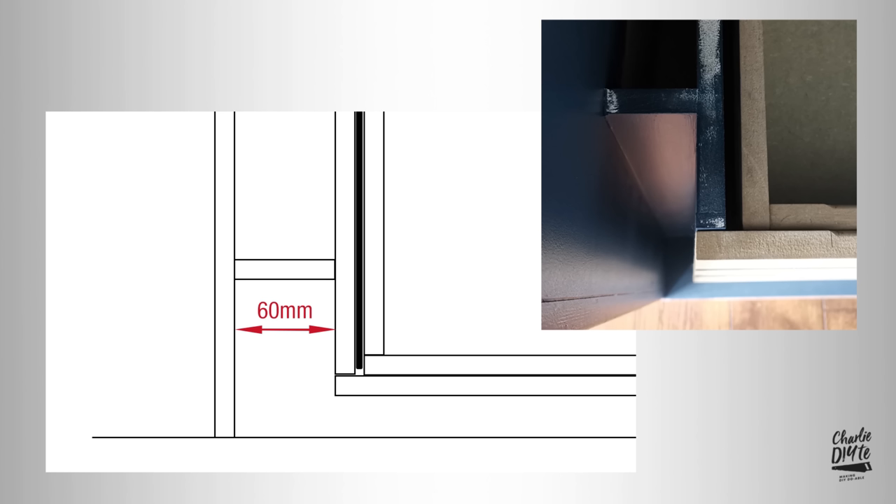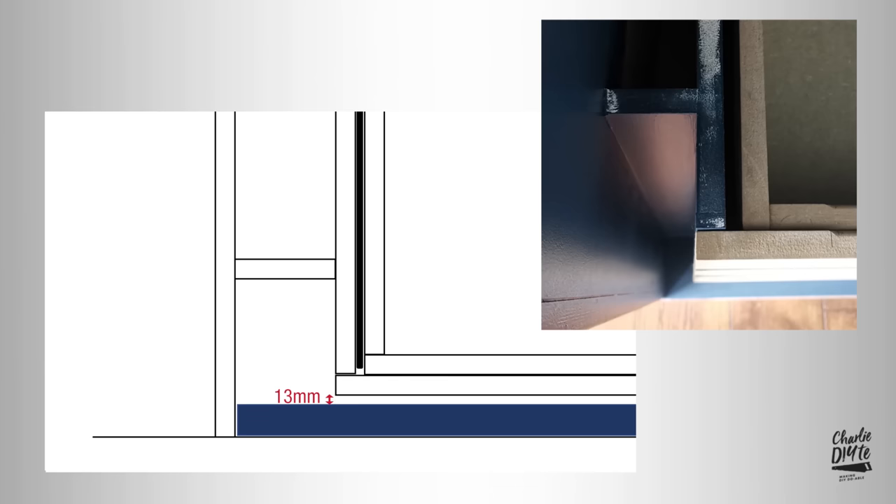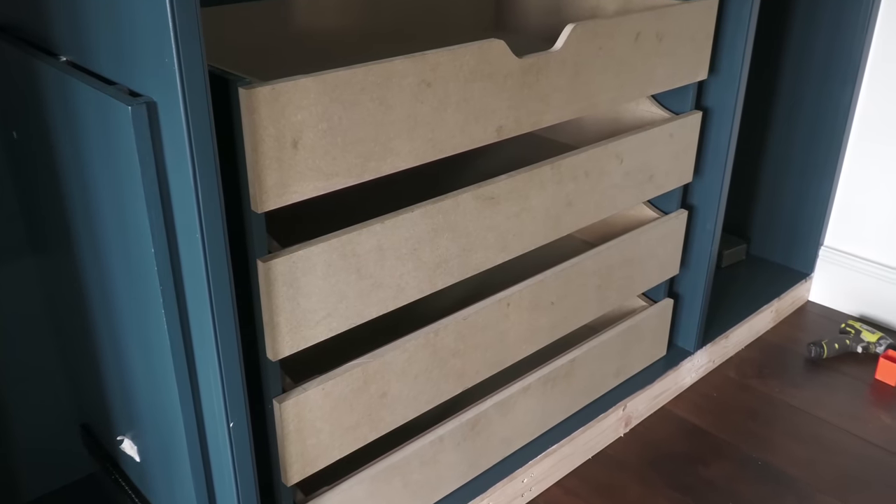I decided to make the frames to these dimensions, my wife being particularly keen that there was plenty of clearance from the doors. The exception being this single door wardrobe where there are no hinges on this side, so I've minimised the depth for the spacers and brought them forward as otherwise it would have been a nightmare to paint in the gap. To maximise storage space I've left just 10 to 13mm clearance between the front of the drawer and the doors when the doors are shut. Obviously you'll need more if you plan to put knobs on the front of your drawers rather than the more minimalist design that I've opted for.